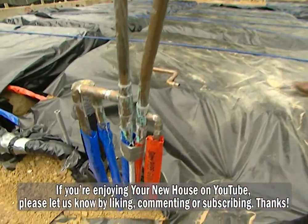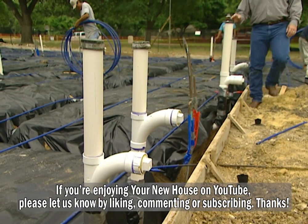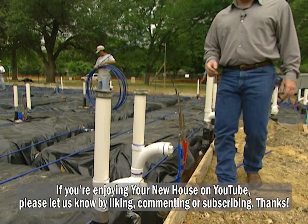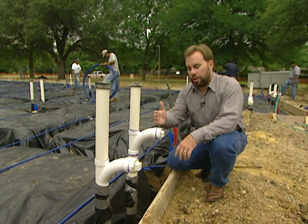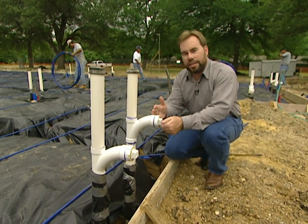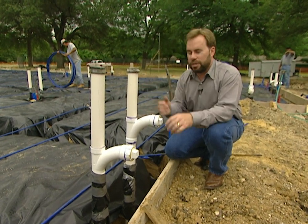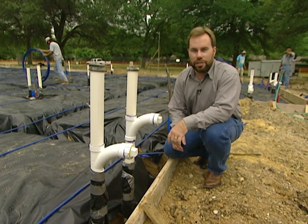Let me show you one thing on the drain pipes over in the kitchen. You'll notice on our four drains over here in the kitchen wall that we have a piece of pipe protruding from each one of them with a cap on the end. These are our clean-outs. If we ever get a clog inside one of these pipes, the plumber just comes out to the outside of your house — because this is where our wall is — takes the cap off, runs a snake in there, and cleans out your drain. They don't have to come inside your house or make a mess or tear up anything. They have easy access to each one of these caps.